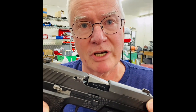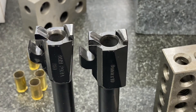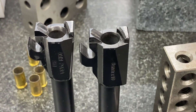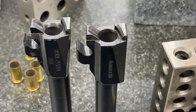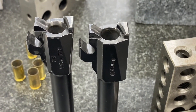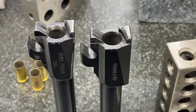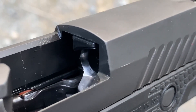We've proven that the P320 won't fire dangerously out of battery such that it can blow cases. So there are folks saying maybe it's because of a lack of chamber support. If P320s were blowing cases because of lack of case wall support, then you'd think the barrel on the left that I've modified and deepened to about 290 thousandths from the breech face to the point at which case wall support actually starts would give us some pretty spectacular results. That is an unsupported chamber if I've ever seen one.